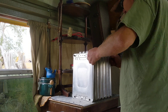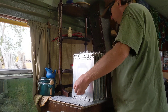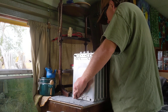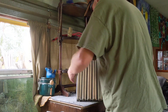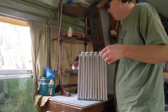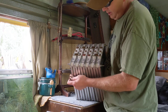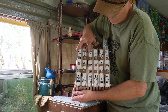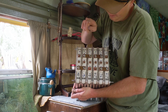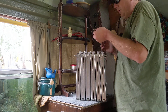This would be the difference in the process if you're going to have more than two packs. This is a simple way to do it with just two of them. If you wanted to do more, there's an easier way to combine them if you're going to have more than two packs. So — bus bar, positive to positive right here. Essentially we've got two 24-volt batteries. We are going to parallel them, positive to positive, and then we're going to take this negative to this negative with a six-gauge wire. But right here we can just use a bus bar.